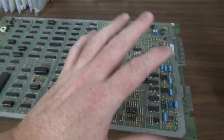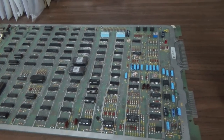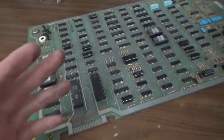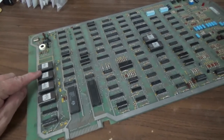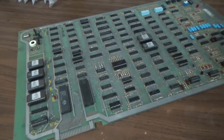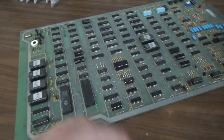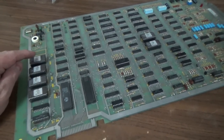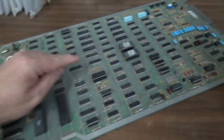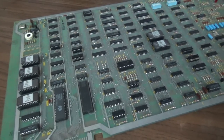Okay. So if you know your power supply is fine and your board is definitely the problem, which is where we're at with ours because we've already checked all of the power supply voltages, then you're to the point that we're at now, right? So what we've already done is, we took all of these EEPROMs out and checked them in an EEPROM burner to see if they're correct, right? You probably don't have an EEPROM burner unless you're in the hobby. And if you're in the hobby, then you probably already know all of the stuff that we're talking about. But you have to make sure that the files are good on these chips. The good news is the files are usually good on those chips. If you look, these are actually the original ones with the original stickers on a 42-year-old game, and they're still fine. So usually you don't have a problem with them, but sometimes you do.